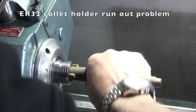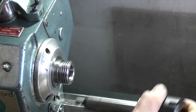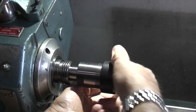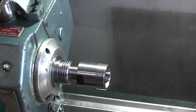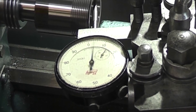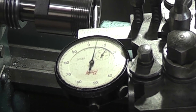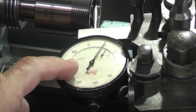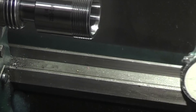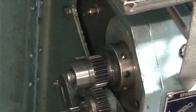The first thing to do is clean the taper. What I'm going to do is just tap this in. Take off the nut. And we'll check what the bore run out is without the drawbar. So without the drawbar fitted, that's running out one thou. Zero to one — the dial indicator is in tenths, 0.0001. So now what I'll do is fit the drawbar. Centralizing bush and the nut.